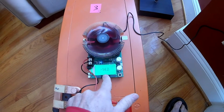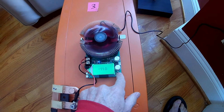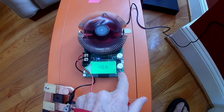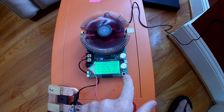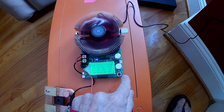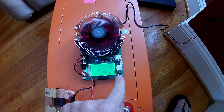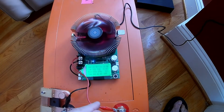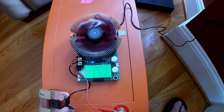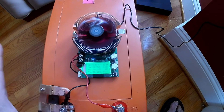If you want to change a setting — for example, battery high, battery low at 11 volts, amperage maximum at 12, 178 watts — I finally figured out that on certain screens, two presses means going up and three presses means going down. You fine-tune it with that. But there is no indication anywhere and the instruction manual is terrible.